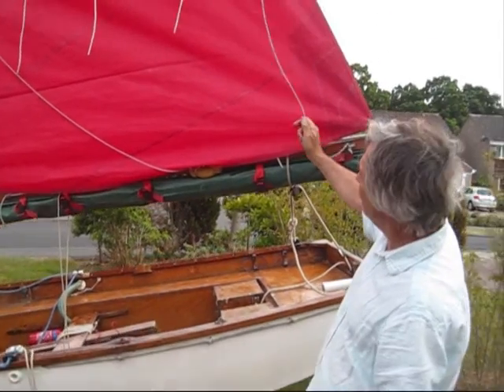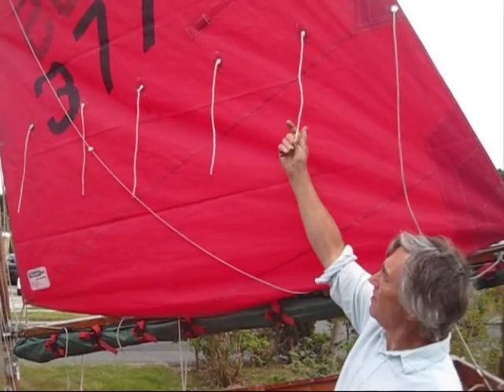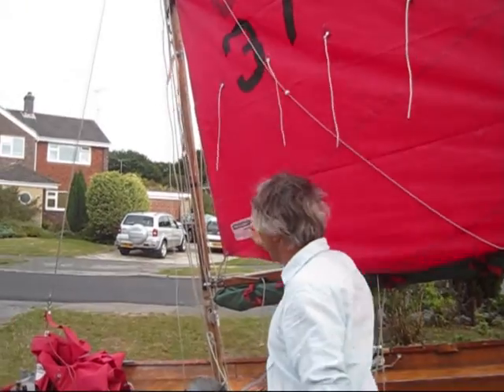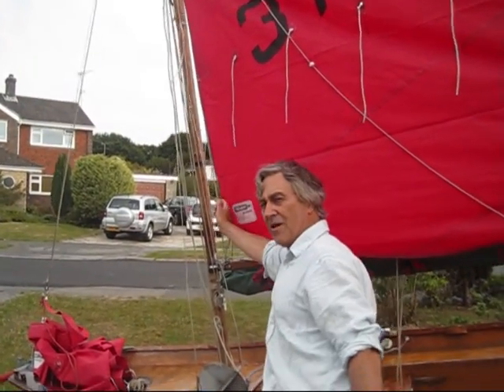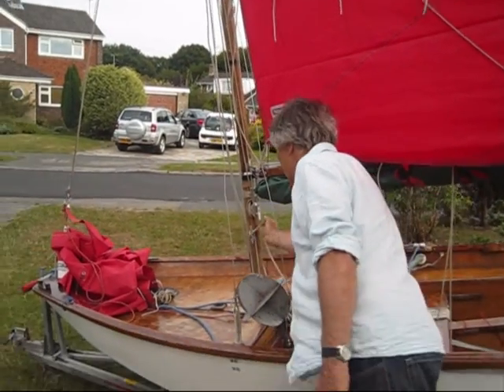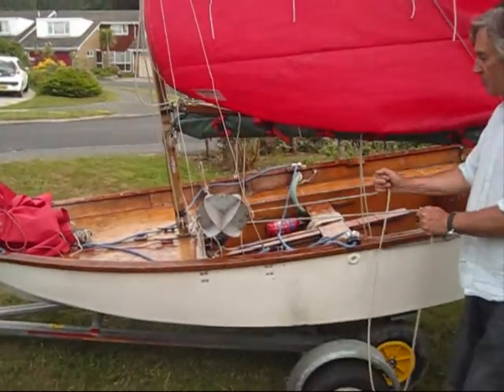So you see these — these are for pulling down the sail. These are for tying in the bunt of the sail that went down. There's another one here. This is a reef pendant, pulling the sail down. So that we keep the gaff right up close to the mast. So two halyards, which I'll show you in a moment.